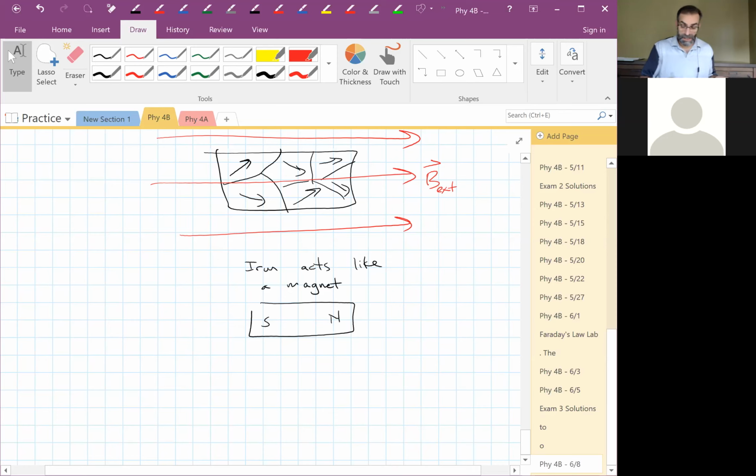Yeah, with iron, with ferromagnetic materials, a shock hitting them, dropping them, will often cause the magnetic moments to go out a little bit. You can get them to align by putting it into a strong magnetic field, as we saw here. They align. If we take that strong field away, they will stay. Oftentimes those domains might go back a little bit, but they'll sort of stay aligned, and now you have a permanent magnet. You can take a piece of iron, put it into a strong magnetic field and make it into a permanent magnet.